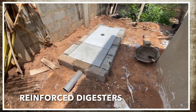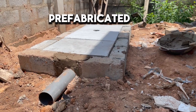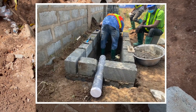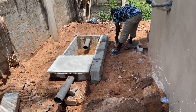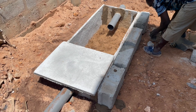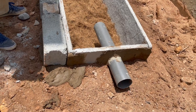When you are doing a biodigester you can consider this format — one of the best ways of securing and protecting the biodigester you are constructing is using prefabricated slabs. Whenever you construct a biodigester, you have options: prefabricated slabs, block corridors, or bricks depending on your location. When using prefabricated slabs made at the warehouse and brought to site, you install them, hold them firmly, and do the mortar work.